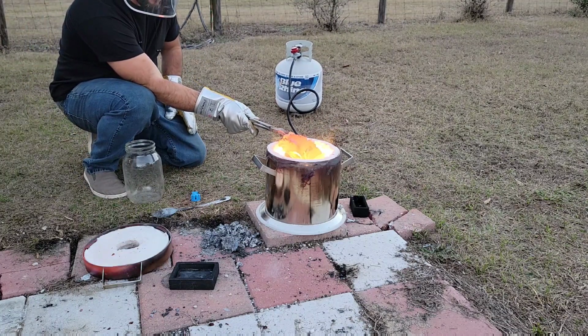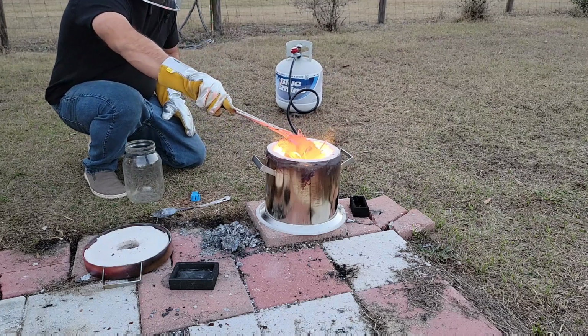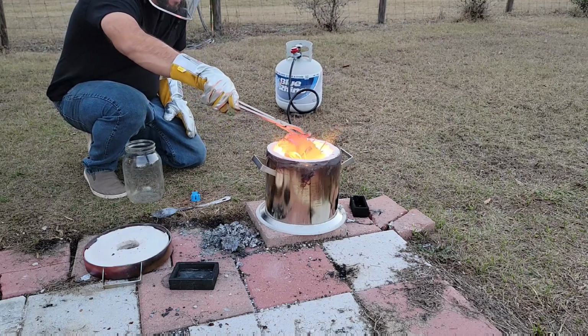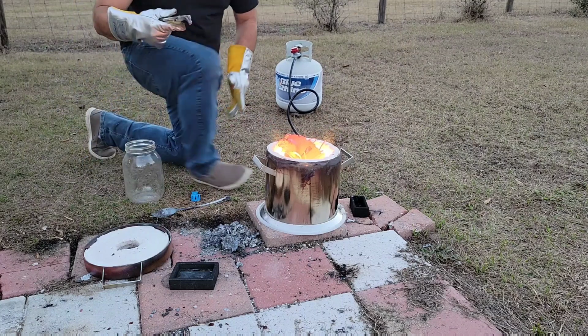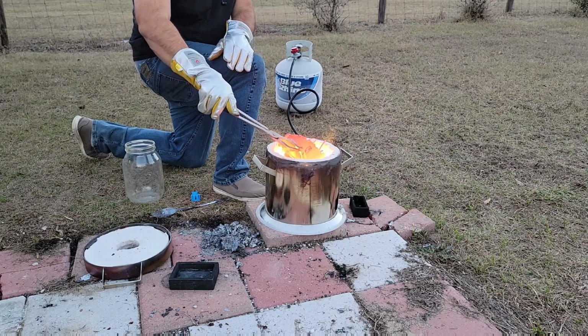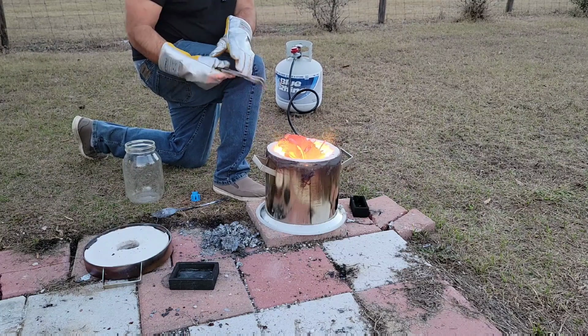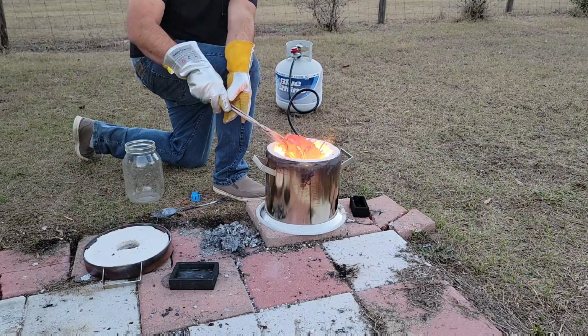With the lid off, I'm examining the copper to see if any of the extremities of the copper have started to melt. And then I test and see how malleable it is. Some of the smaller wires are malleable, but that really large chunk isn't too malleable, so I'll have to let this heat up for a good bit longer before I'll actually be able to bend it into the crucible and turn this into a molten metal.